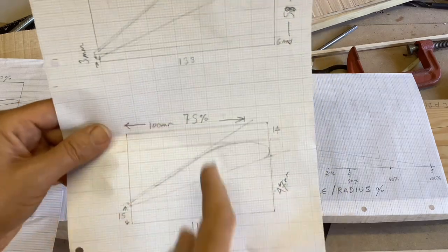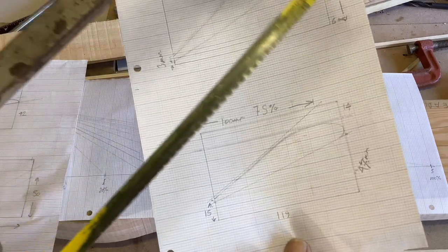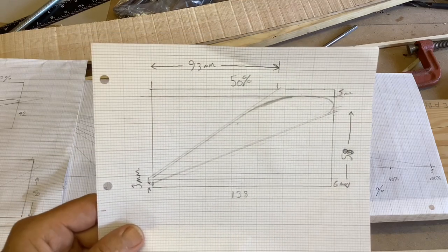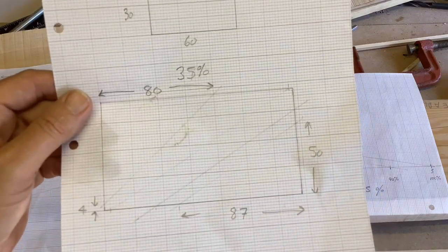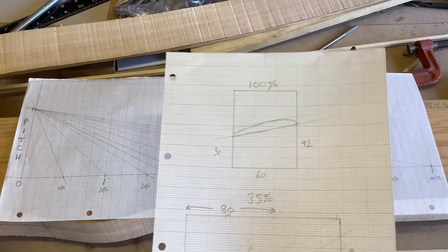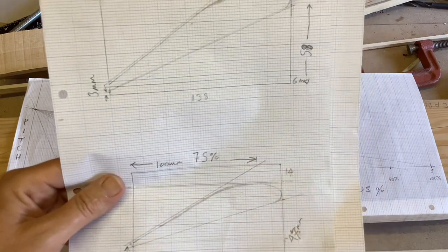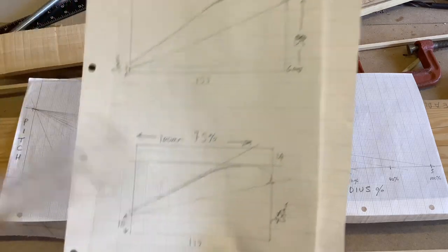Some people say the back of the blade is the curved bit and the face is the bit that does the work — anyway we won't get muddled up. The measurements allow me to mark up the blank ready to attack with a saw. The 50 station has an aerofoil drawn in with guidance for marking the blank. The 35 station is slightly tricky because you can go flat blade or flat back of the blade, and although the twist differs at each station the angle is taken from the diagram.